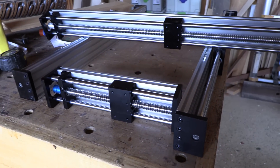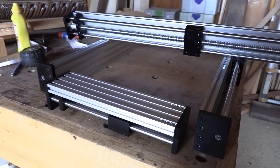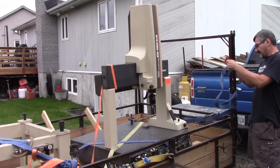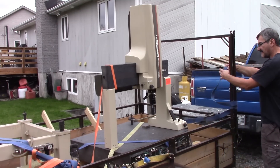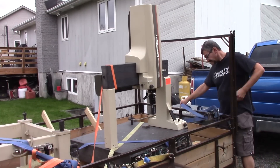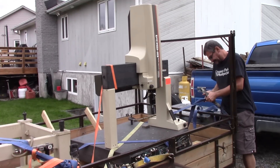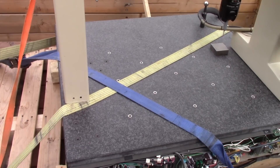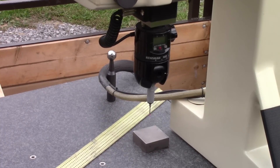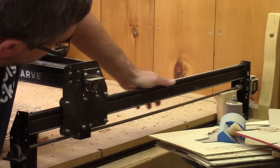I started by buying a bunch of high precision ball screws. Pierre came to the shop to figure out how we can make a rigid CNC with this. At the beginning of October 2020, before we even started, Pierre told me to buy this CMM. If you don't have a clue what a CMM is, it's a high precision three-dimensional measuring tool. This machine dates back to 1990. Just by looking at the seven-inch granite top, the granite beam for the X and all the rest — which is cast iron — I'm sure there won't be any flex with this. Unlike extruded aluminum.